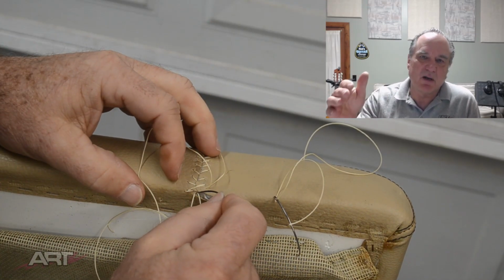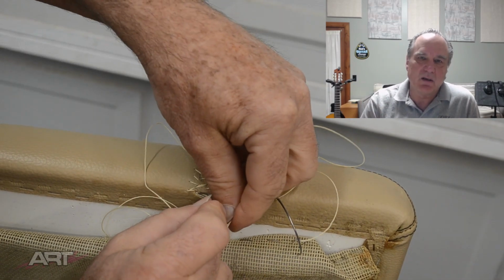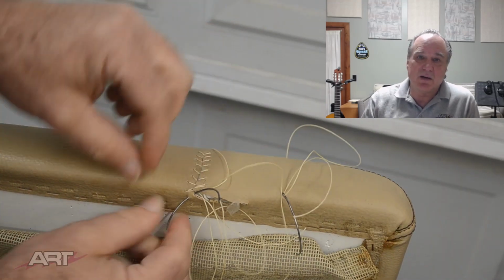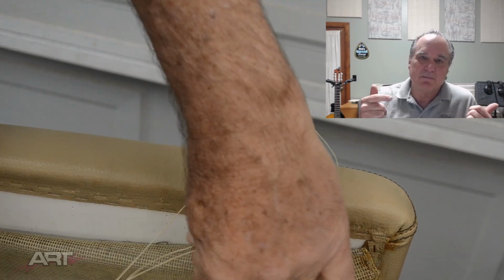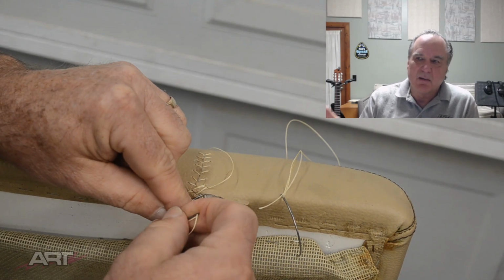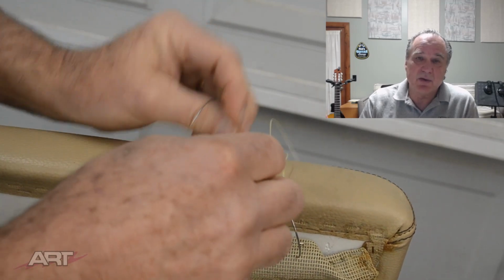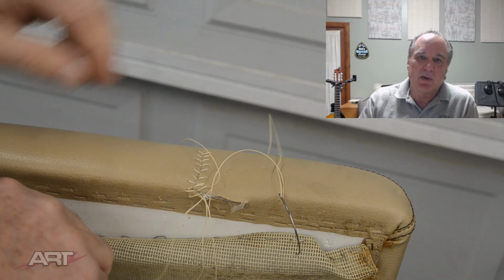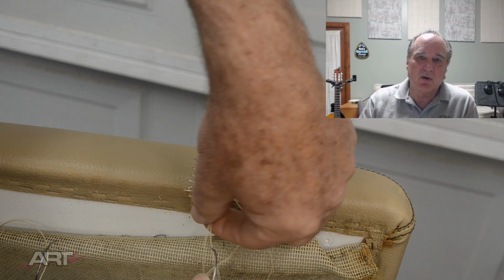Now you've got a lump there. The repair compound's too high. The vinyl's all wavy anyway. So how do you correct that? Well, I can't correct it here at this point. That is everything that really should have been addressed on the front end. But here I'm trying to correct it on the back end, going over and over and over, and it's impossible now to do. So I'm wasting time on the back end, and I'm having to either give up or tear it all out and start over again.